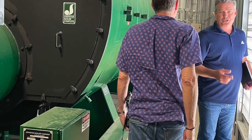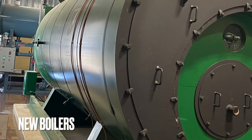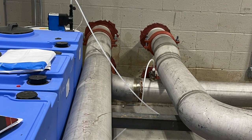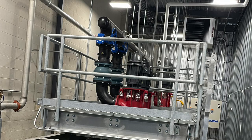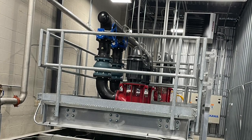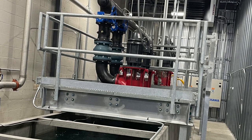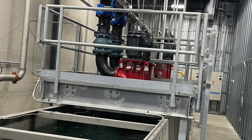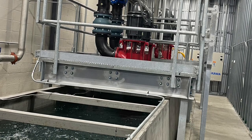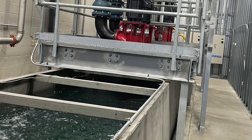All of this piping was essentially under the trench. In here we've got the cooling water returning to the hot tank, then it goes to the cooling towers, then back to the cold tank and then to the process area — it's on a constant loop. Same with the steam: it's on a big loop and the condensate comes back to the surge tank. We reuse as much of the heat as we can. The pumps are pumping about 1,600 gallons a minute, all on variable frequency drive controls monitoring temperature — everything's fully automated.